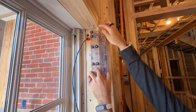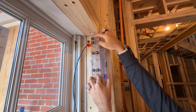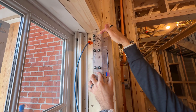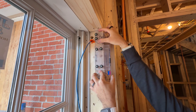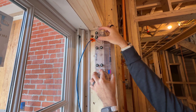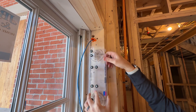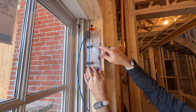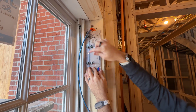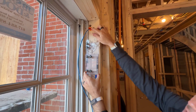The adjustments here take into account the blue board — half inch blue board, you adjust here, and then another quarter inch for the shade. If it was a longer shade, you might make this adjustment one inch instead of three quarter inches. You turn the knobs and adjust down. That's how you get this perfectly aligned — you move these around, make sure you're lining up with window side, do your adjustments, and drill that hole in the middle for your orange tube.